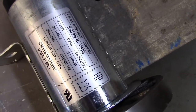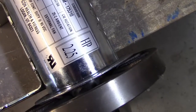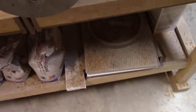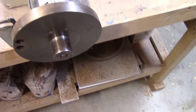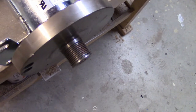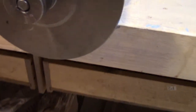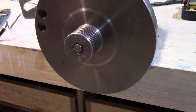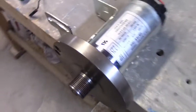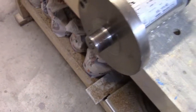Here's all the guts on the bench. This motor is hard to believe - it's just 2.2 horsepower, 1.3 continuous duty, 95 volts. I'd like to keep this flywheel on here, so I might just try and rig up a regular V-belt pulley to this flywheel somehow. I don't really want to be banging on this motor pulling out that flywheel - it looks like it might be threaded on the shaft. I don't even have an idea, so I'm not going to mess with it. I will fabricobble something.